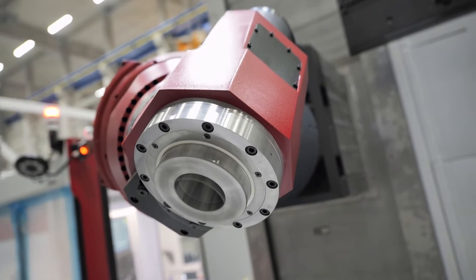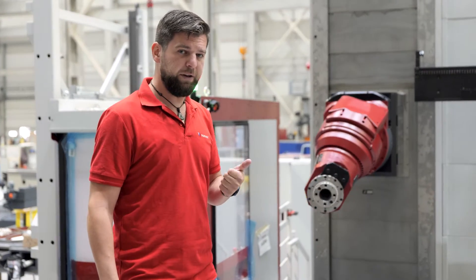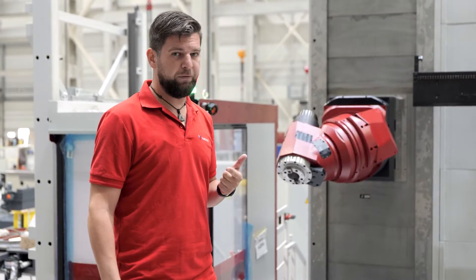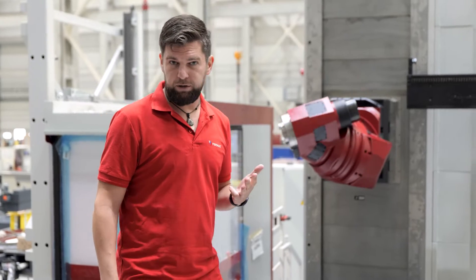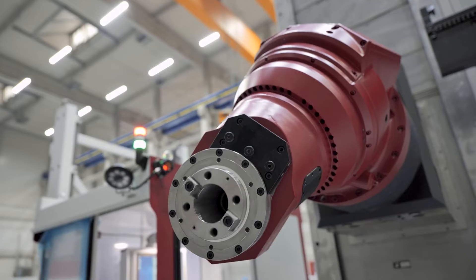And the second are the bearings. We used hybrid ceramic bearings that are lighter and more thermally stable, and therefore they can keep their chill — by means of an oil cooling unit. It's a design very similar to the bearings of the headstock.